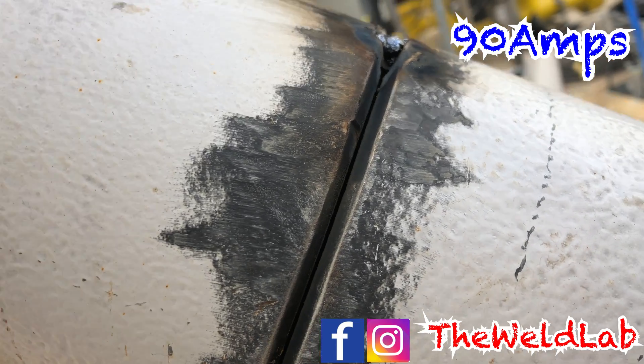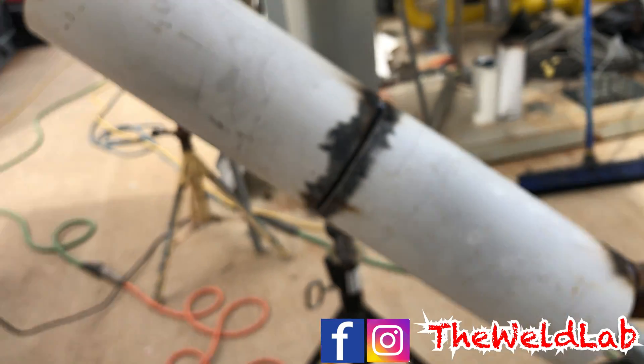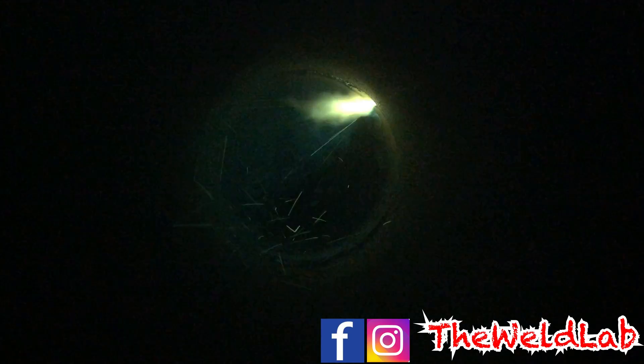My left side is done. My right side's gap is a little closed up so I decided to do 90 amps on this side. Usually if the gap looks like a blade could easily fit in there I'll start at 80 amps. Now when I jumped into the right side it was a little bit tighter, and if your blade cannot fit in that gap it's a good indication that you need to crank it up to 90 amps. So basically make sure to know your gap sizes.